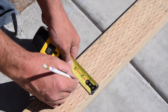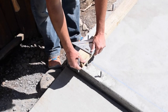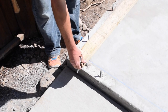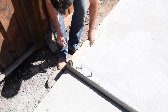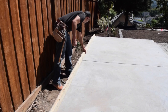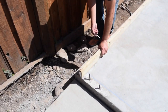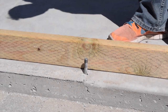on the bottom plates. Start with one of the longer walls and cut a bottom plate to the length of the wall. Make a mark 3.5 inches in from the end of the board. Stand it on its edge and align the mark with the perpendicular adjacent wall mark. Push the board up against the bolts, making sure to keep the mark on the board aligned with the perpendicular wall mark. Trace both sides of every bolt onto the board.